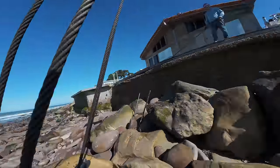What we should do is probably put a chain on the top to hold it down, and then the other chain to wrap around. All right, give me a little slack. See if you can get that chain under that side of the rock there. Once you get that chain around, take the end of it, step over, and wrap around so they can't separate.